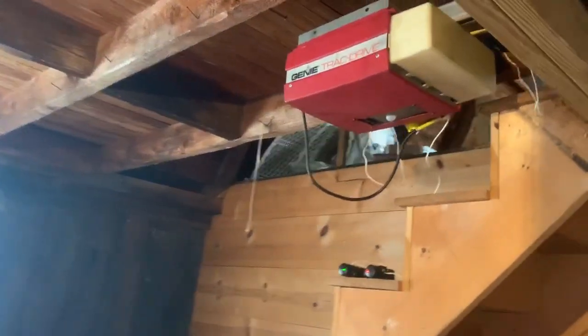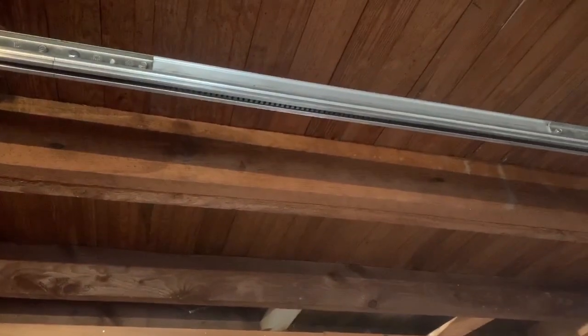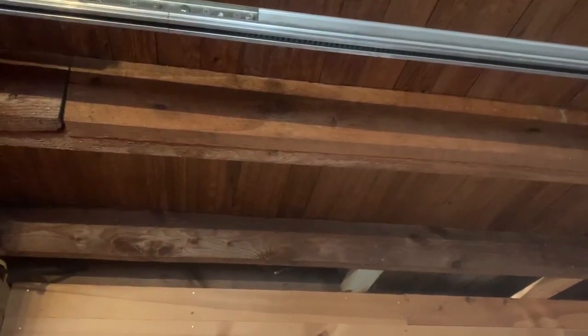The other modification that I made — if you'll look, you'll see that this uses a different tape. This is the standard punch from Dimetrol, which is the company that makes the Genie Track Drive tapes, or did make them at one time. This is their standard mechanical drive tape. I put in a different pulley, or sprocket, up on top and had to modify the drive housing a little bit so it would accept this tape. Essentially this tape is better because of the smaller holes — there are more of them — and it allows a bit better flex when going through the housing, so it's not quite as likely to wear out.